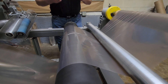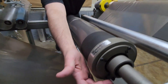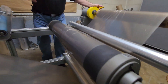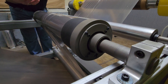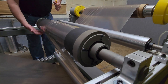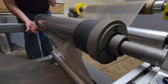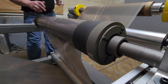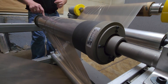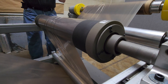The wrinkle stop is not adjusted right now. What I'm going to do is adjust it — there's an adjustment screw under here, and the same adjustment screws on the other side of the roll. If you go look at the stop videos on our website, I'll explain more about how that works. But where those screws are is where the sleeve is fully contracted. So it's contracted here — the web enters on the contracted side of the sleeve, wraps around the roll, exits on the expanded side. As this roll is rotating, this rubber sleeve is stretching and that's what's pulling the wrinkles out.